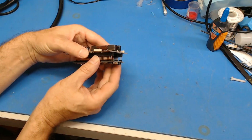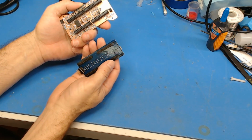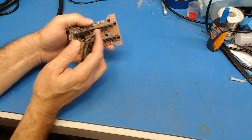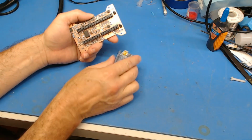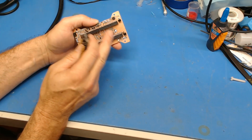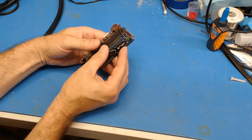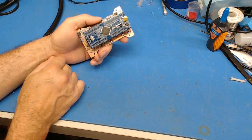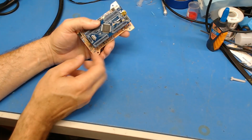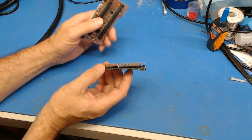Now my big problem is that I got the pinout wrong. Because I was being cheap and trying to reuse parts I had, this connector is actually not the pin count of what the header is, so there had to be no connect pins, and that messed up the pin ordering that I had put in. When I went to plug in my board and did an impedance check on the rails, I found out it was shorted out, and then going back and finding out that the pinout was wrong was frustrating.